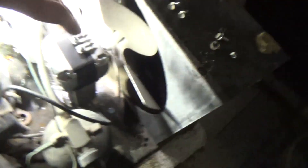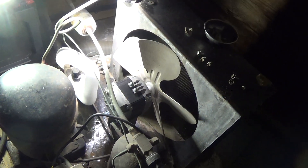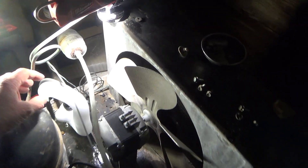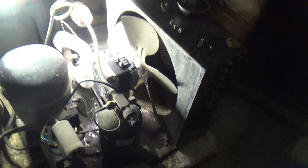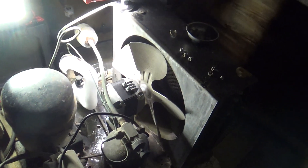It's not catching - we've got roughly even spacing either side, because you can move that side to side on the bolts. We've got this off on the stat but with the fan still running inside, so if it had any more ice in there it could melt it. I think that drain has stopped dripping, so we're probably fully defrosted. We'll turn the power off before we get electrocuted, get that wired in and see what it does.